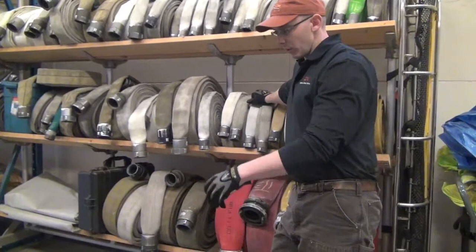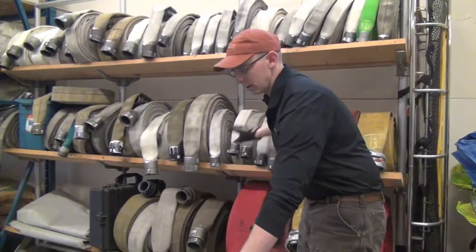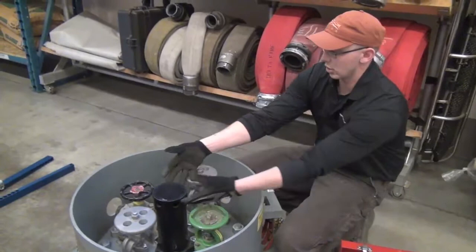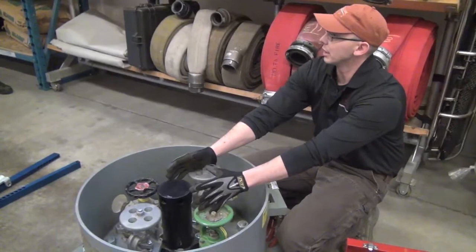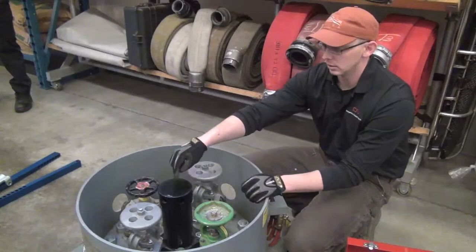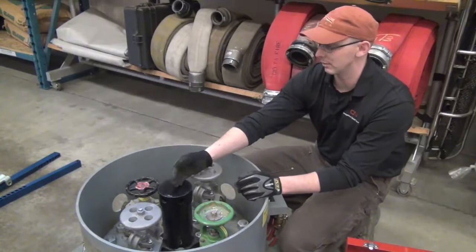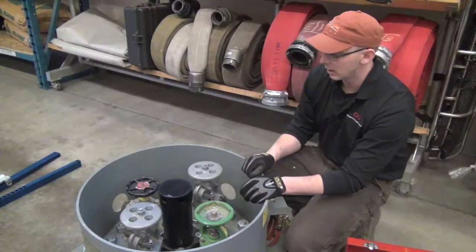We may need to take a pressure on the car. If we've gone through all our easy fixes and can't dial in what's going on - it's not a valve, everything seems right, and the safety valve is leaking - we're discharging through those ports. What do we really need to know about the safety valve? The Midland kit lets us isolate and seal it off, but first we need to know the car's pressure relative to the start-to-discharge pressure. The good thing is you don't have to remember - it's stenciled on the right side of the car. For a chlorine car it'll say 375 PSI. If the car is sitting at 370 and this is starting to weep, that makes sense.